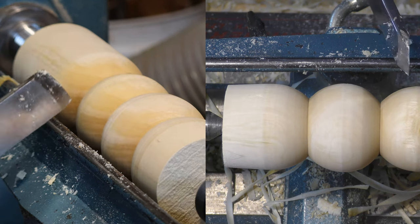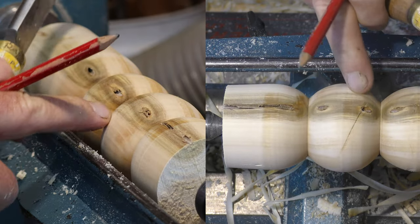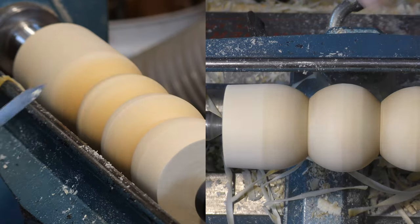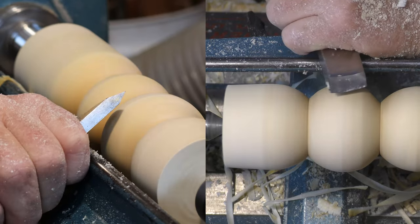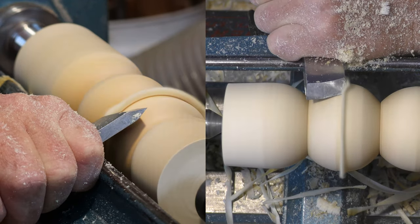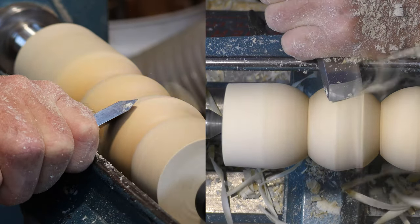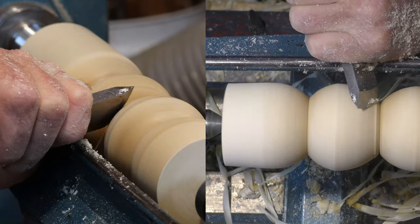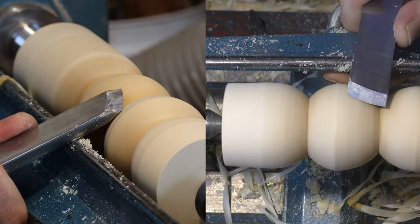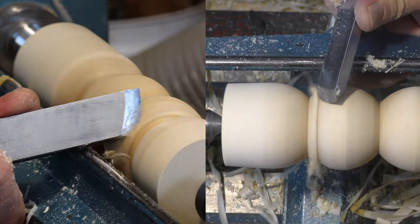Most of the evidence has gone — there's a little bit of picked up grain. I've still got my big catch there, so just get rid of that. Coming in on the top of a bead, I'm going to swing the tool, swing the short corner through and off, so the bevel's rubbing underneath here. Going the other way — short corner that time.